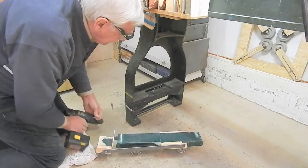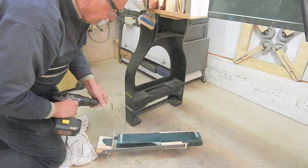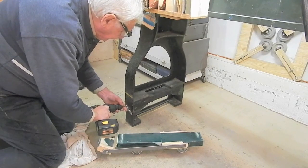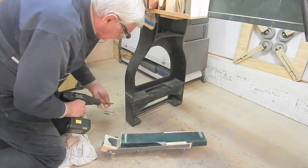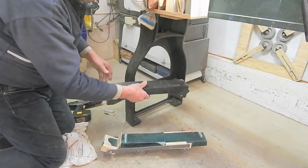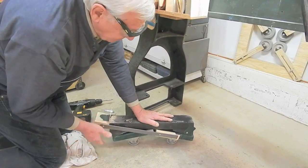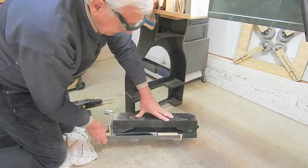I've added some pads in the leg webbing here for the jacking system to act on. There are the pads by which the lathe is jacked up. So in summary: when the casters are retracted, the legs are down. When I push down on the pedal, it jacks the lathe up.